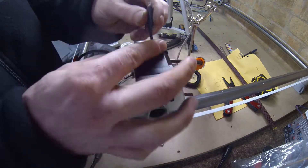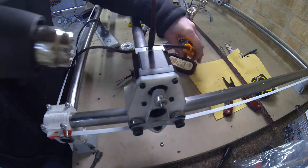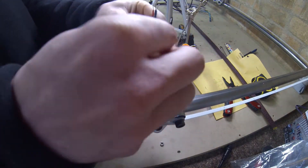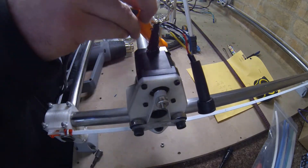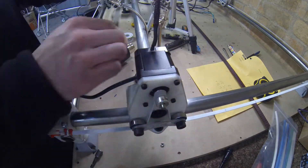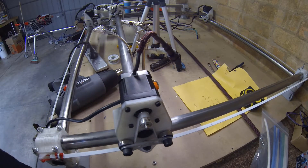The way I chose to wire the plug to the stepper motor was to pre-shrink a piece of heat shrink tube so I could slide it even further down inside the stepper motor. I then slid the PETG braiding down inside the heat shrink and heat shrunk it down with a heat gun. After that I pulled the braiding back to expose the wires, pinched it down with my soldering stand, and then connected and soldered the male aviation plug. I also slid on a piece of heat shrink over the plug and braiding.